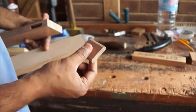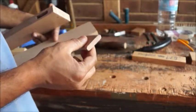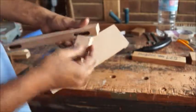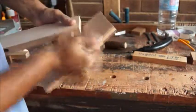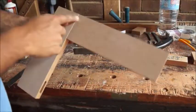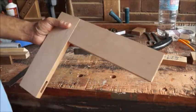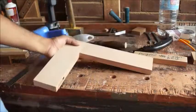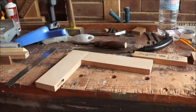In my case it's three-eighths inch thick, so this stock here is nine and a half millimetres. Round the corners off because we've got rounded corners on our actual mortises. Slip that into the mortise — it should be a reasonably good squeeze. In goes the other piece and there you've got a nice clean looking joint. That's going to hold for a very long time if you glue it up with just enough space for the glue. Hope you've enjoyed this short video on how to make loose tenons using my very simple jig. Thanks for watching.